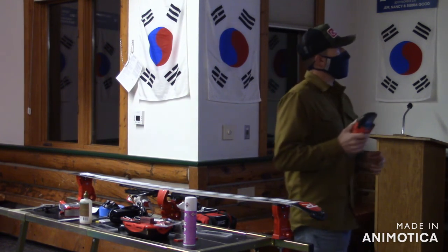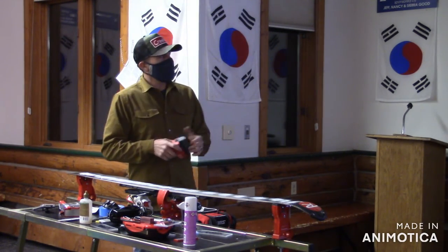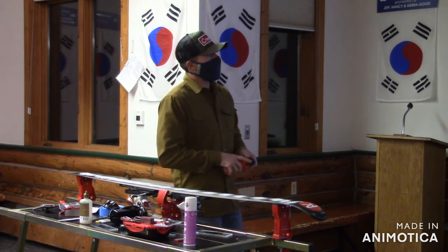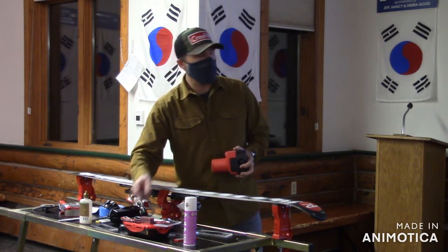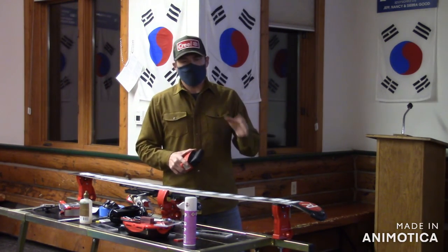The cool thing about this machine is it sweeps up while it's cutting. Most of the machines sweep down, so they end up leaving the skis really hot. They're not burred, but they're really aggressive. So it requires going back to the ski and doing that touch-up with the diamond stone and the ceramic stone, I should say. With this spinning up the edge, you can sharpen the ski and you can ski on it as is.